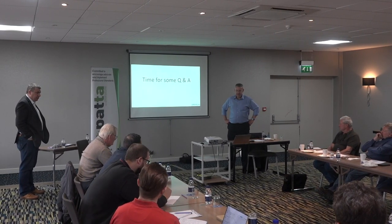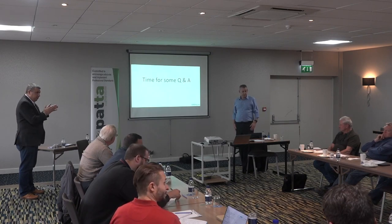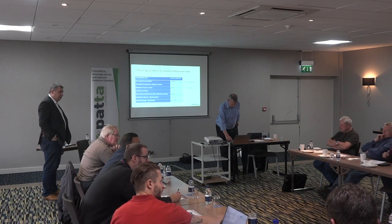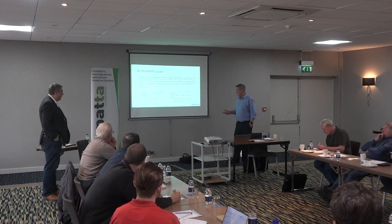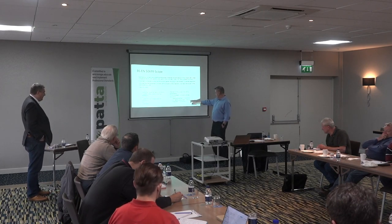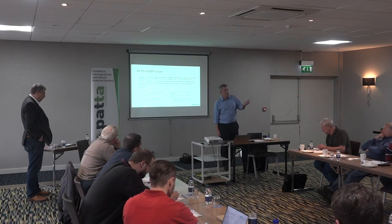Question from the audience about the BS EN standard for arc welders. The relevant standard is IEC 60974-4. Seaward's distributor asked about eight years ago whether we could make a welding adapter for PAT testers, since there was no standard at that time covering it — you'd need to measure leakage from the electrode and isolation of electrodes from ground.